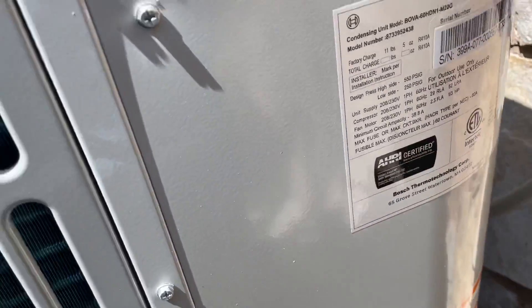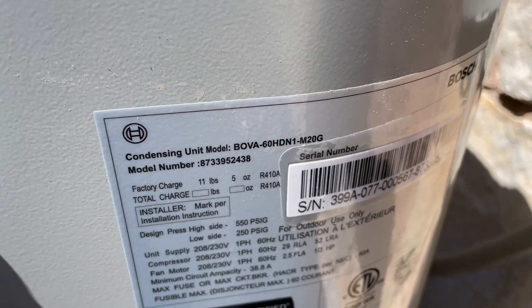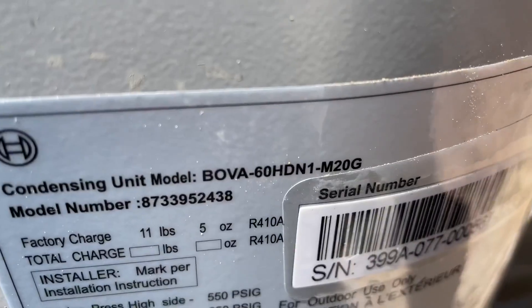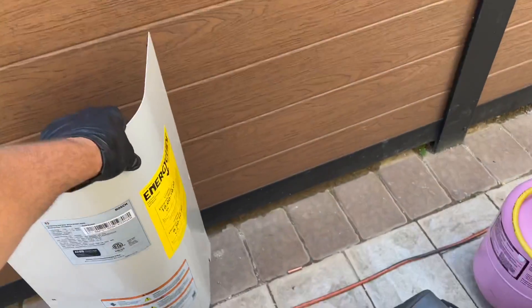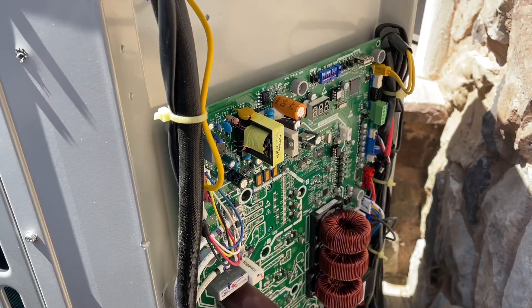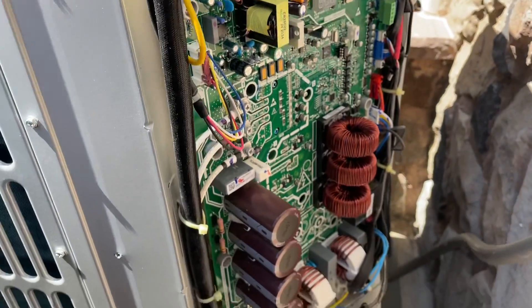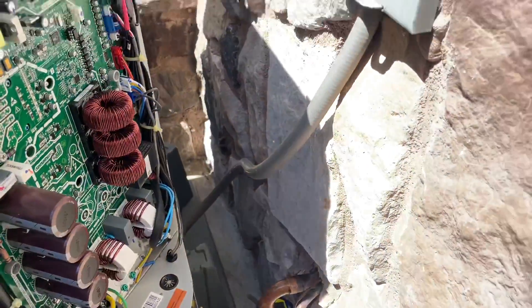While this is pumping down, I'm going to take off the access panel and wire in my low voltage. Let's take off the electrical panel access cover off this BOVA 60 HD — it's a five-ton unit with a four-ton air handler. A lot of you say KISS — keep it simple, stupid — well this looks complex, but what's really simple is the amount of money this client is going to save on their electric consumption. In the bottom I have terminal block L1, L2, and ground — I'll take that from my whip.